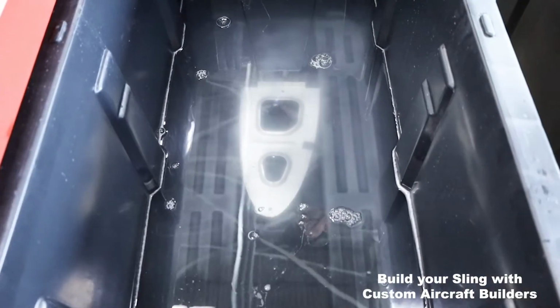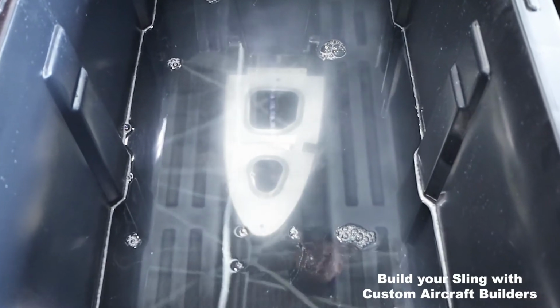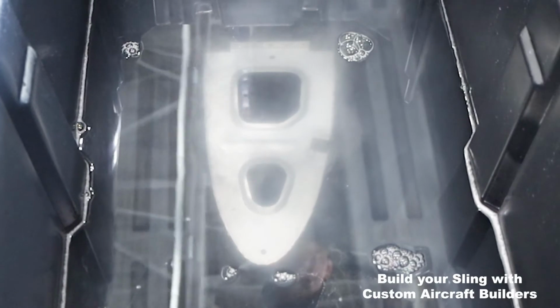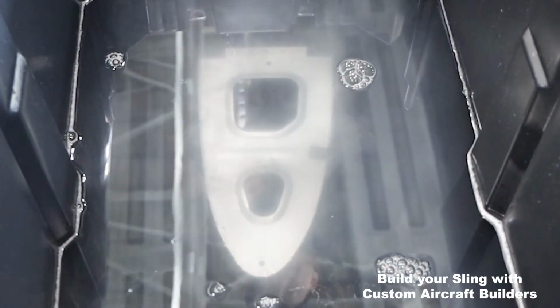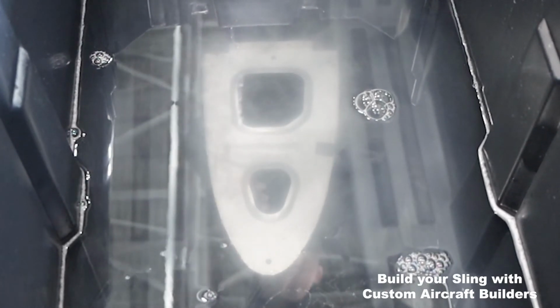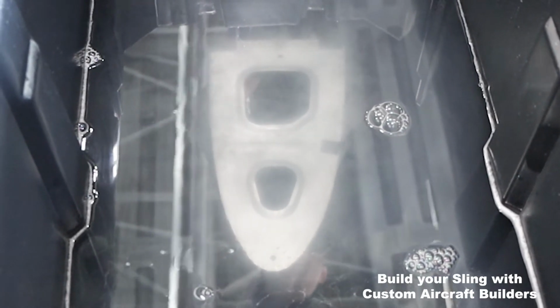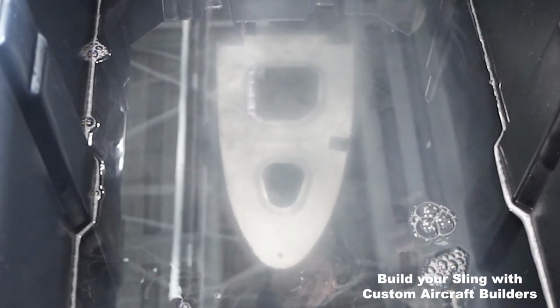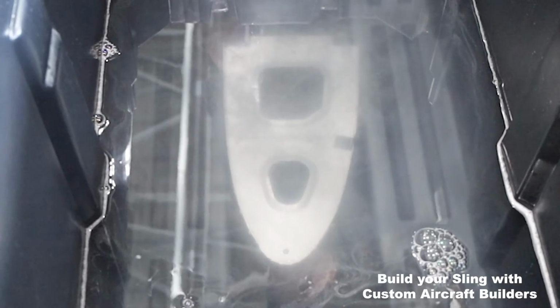So as you can see, the etching process has started, and it kind of looks like it's smoking, or you can see little bubbles coming off of it. It's basically prepping the surface and cleaning the surface. In fact, the Bonderite instructions even say if you are doing really clean work like this, that you can thin this stuff out a little bit. And if you're doing really heavy corrosion, you'd want to maybe do 2 to 1 to prep the surface.